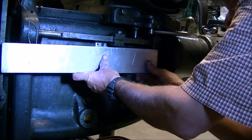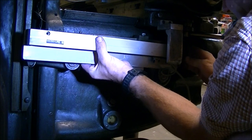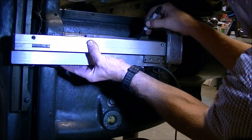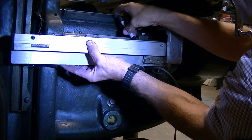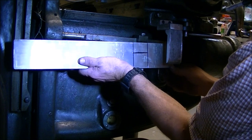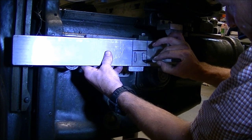So here's the big piece of plate - it's about 3 inches wide by 1.5 inch thick - that I'm going to use to mount the scale to. And then there's the bracket that mounts to the table for the reader head to run on. Just marking out this piece of aluminum bar so I can know where to make the slots for the mounting holes. There it is kind of marked out and just eyeballing in some slots for the mounting bolts.